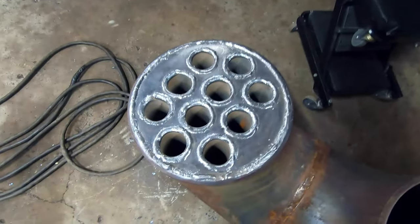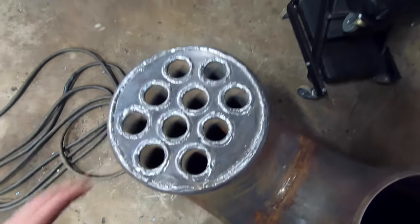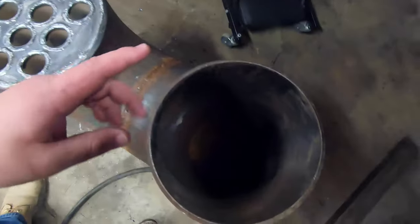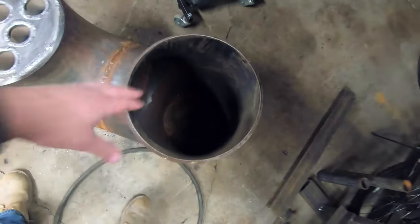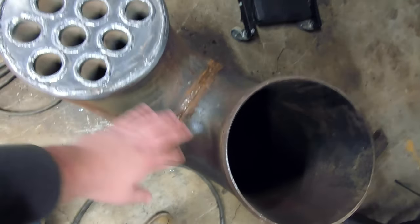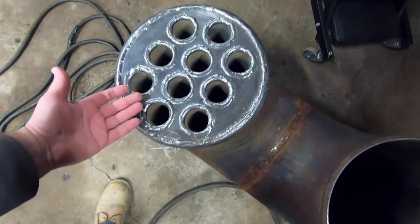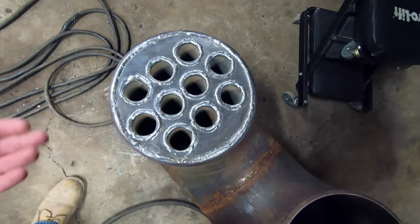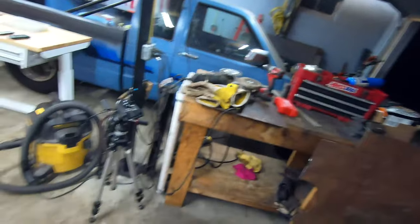All right, moving right along. We got tubes. That's a little hot still. Oops. Here's our heat exchanger tubes. Again, here's our firebox. Let a big old fire in here. It'll come up through this area, hit these tubes, and then I'll have a fan on the backside that's gonna blow all that air out into the garage area.